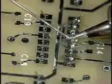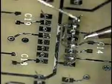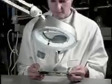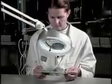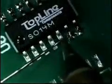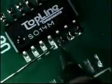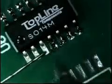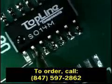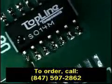Other companies have tested their materials, processes, and products and established that any amount of residue is acceptable. Another area of concern when inspecting assemblies that have been soldered with low residue flux is the degree of wetting. In most cases, wetting won't be affected by low residue fluxes. Only when parts have marginal solderability or when the soldering process is not optimized will the solder wetting be affected. And in most of these cases, it will still be acceptable.